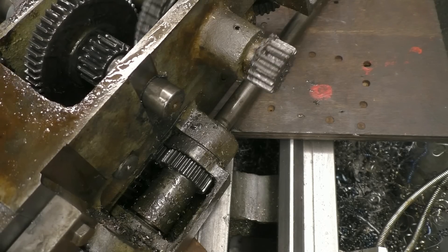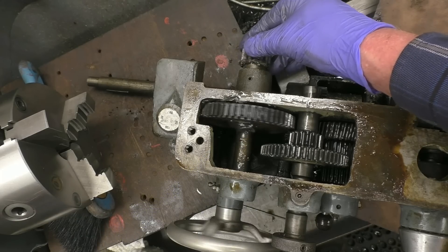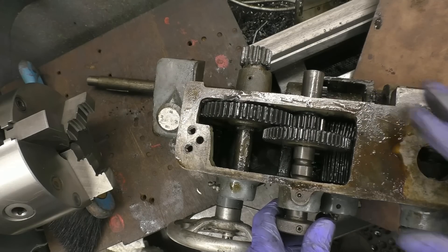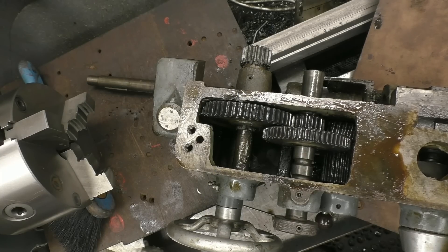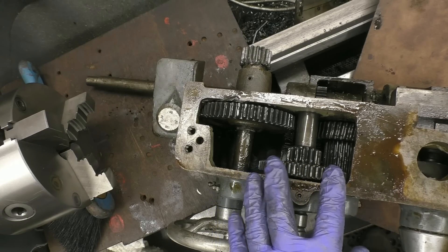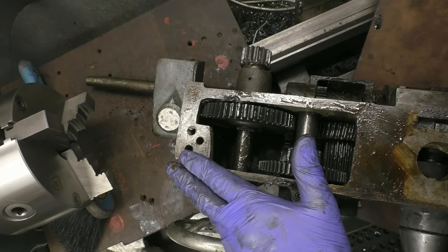I'll bring the camera up and show you how all this works. That's the gear that drives the carriage up and down the rack. You turn the hand wheel and it goes through a gear train in the bottom which reverses the drive as well as slowing it down. So when you turn the hand wheel forward the carriage moves forward, not backwards. It's set up driving through that gear into that gear, which drives the carriage up and down the lathe bed. If you pull it the other way, it engages another gear which turns another one, and that meshes underneath the carriage to drive the cross slide back and forward. The big bronze gear with the worm that drives it — it's all in good nick. All it wants is a proper de-grease, wash out, and put it back together again.